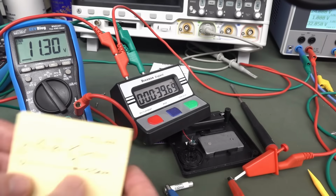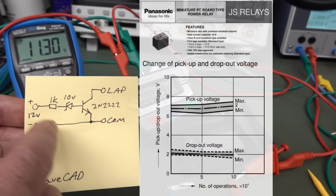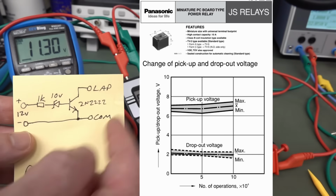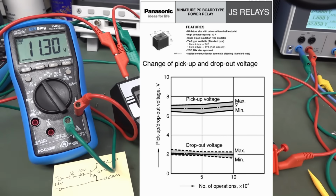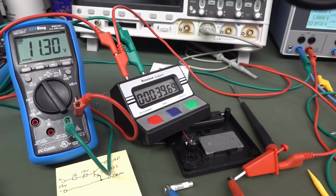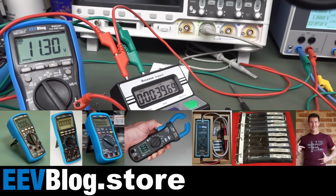So there you go. But as I said, didn't have to use a transistor. Could have just whacked on a 12-volt relay or something like that. And then the coil of the relay would have had maybe like 6 or 7 volts or something to switch that on, that sort of latch-in voltage on the relay. So you can reduce your parts count from 3 down to 1 if you really wanted to, for a bit slower reaction time, you know, milliseconds instead of practically instant for the transistor here. But yeah, we're not that fussy.